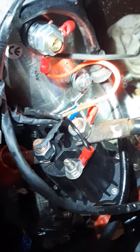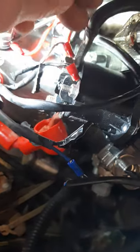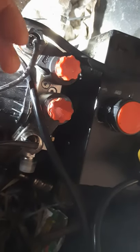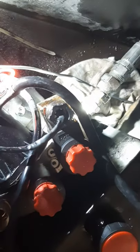The negative is also going down to the lower terminal — there's four posts there. Negative is going down to the lower part of the relay. We got positive and negative there, and then in order to make the solenoid open up and just allow fluid to flow back in, I've got this solenoid — there's a gray and black wire in there — and there's my gray wire going to my down button. Gray from the switch goes to gray on the solenoid and it works like a charm.